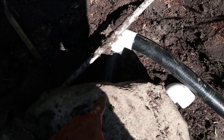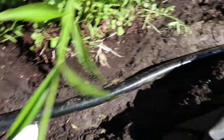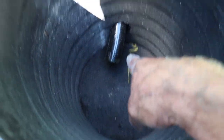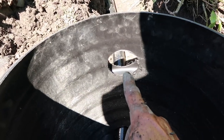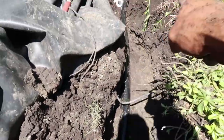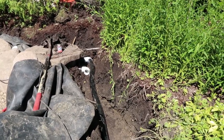The center bulkhead fitting is the overflow, and that is this pipe here — you can see I've trenched it all the way back. I ran a piece of ADS pipe, 15-inch diameter, and drilled two holes in it. One way down in here is my inlet for this sump pit, and the hole right up there is going to be where the ejector line — an inch and a half line — goes back out, sits in this trench, and ties into an existing drain tile that runs out to the front of the street for a pop-up.